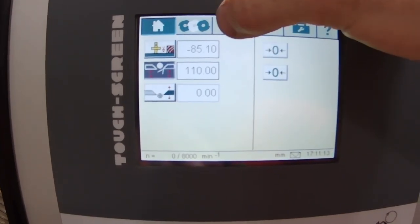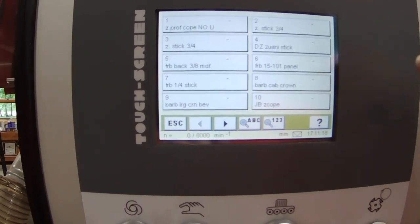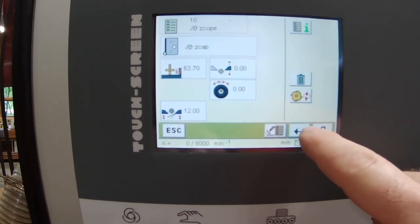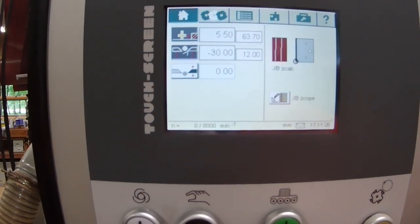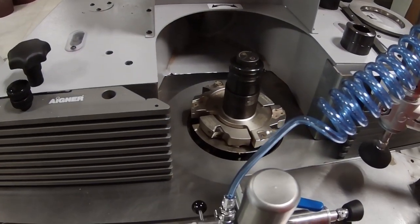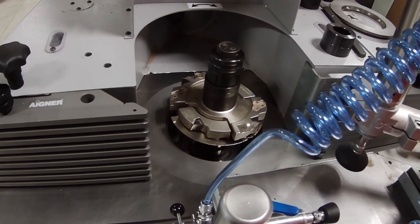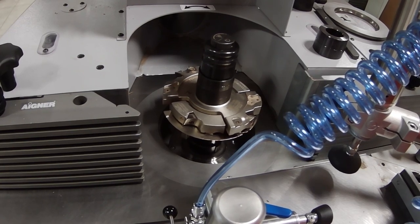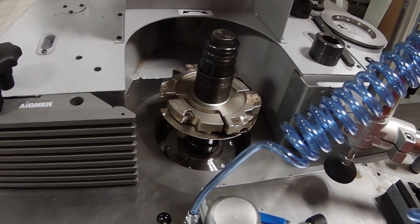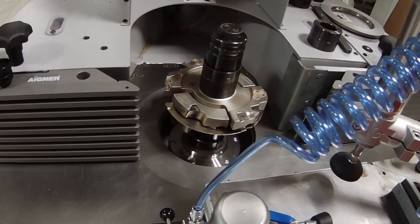Now I tell the shaper to use the program I have pre-configured for the fence and spindle position for this cope set. I select the program, hit enter, hold down the button, and watch the spindle and fence move into the right position for this cutter, in this configuration, with this spacer setup and this sled. If you don't have a precision CNC shaper, that's perfectly fine — next time you make copes, cut yourself a template block and use that to achieve your setup.